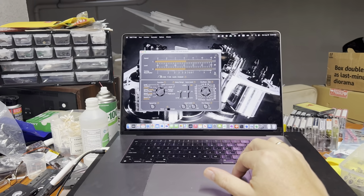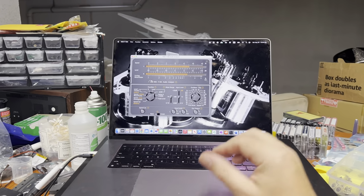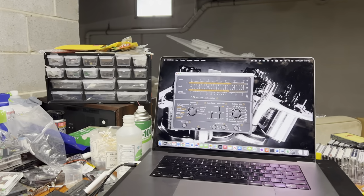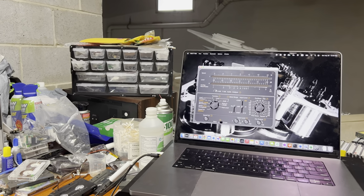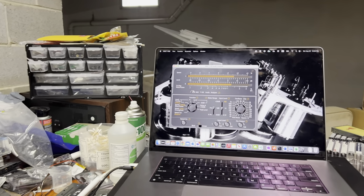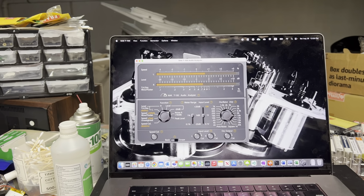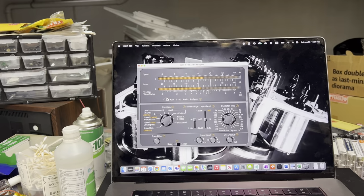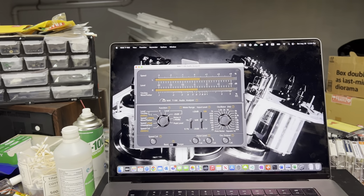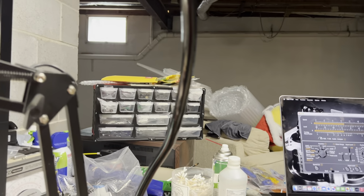Okay. Now we have something wrong, so type 1, it was just recording fine. Let me reload the tape. So yeah, now it's fine. 100 hertz, 10 kilohertz. Something gets really wrong with the bias. That's why it cannot set proper bias. Let me try again.